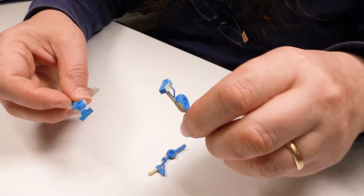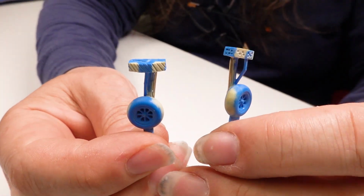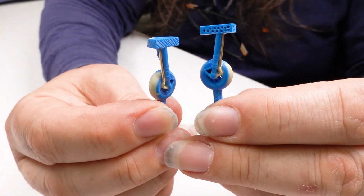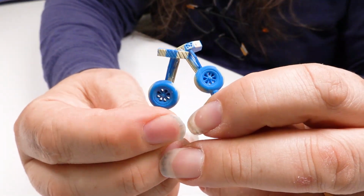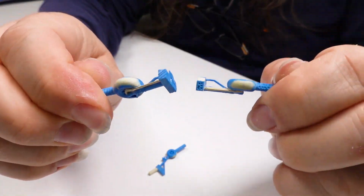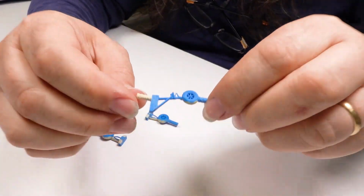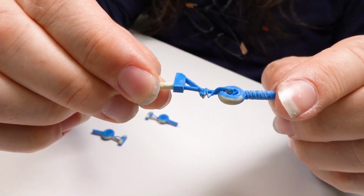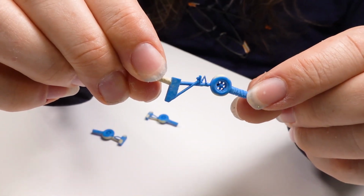I've also been working on the undercarriage parts, getting them ready for bronze casting. They needed some cleaning up and a little milliput here and there, but the resin 3D prints are certainly good enough to be used as masters. By the next episode, I'll have been working full-time on the P-38 and have it in production, so make sure you subscribe to my YouTube channel to see the end result.